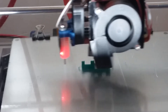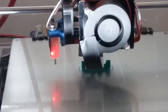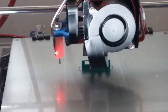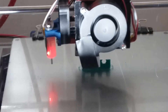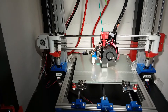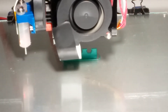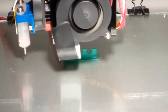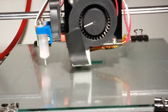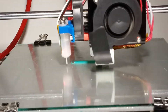I've got a square, a circle, and a hexagon that I'm printing, because those seem to be the worst kinds of shapes — that's where you get the ringing and ghosting on the sides. This is the print with acceleration at 1250, and this is printing with the acceleration setting at 625. It moves a tiny bit slower, but I expect less ghosting and ringing.